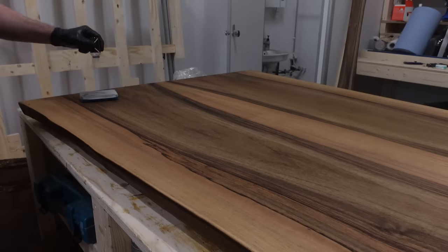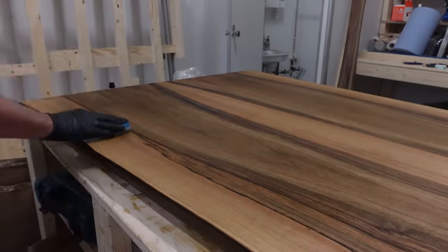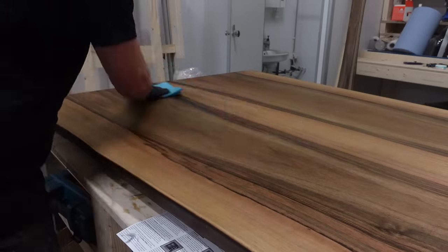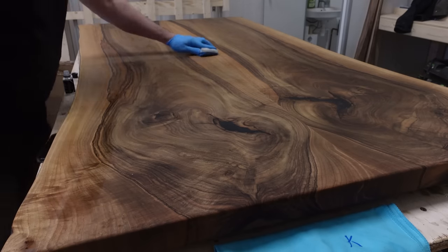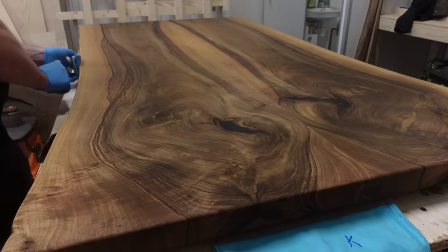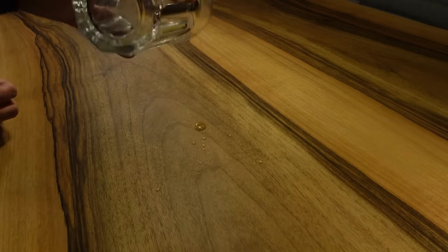With that there's only one thing left — not really mandatory, but I still had some leftover N3 nano coating from my previous table, so I decided to add an extra layer of protection. I have an eight-year-old daughter and both of us make a mess when we eat, so extra protection is pretty useful. I only had a very limited amount of hard coat — it should be done in two or three layers but I only had enough for one layer of hard coat and two layers of top coat. It's probably not the best protection possible, but it seems to be working okay, though it will likely wear out sooner than if applied correctly.